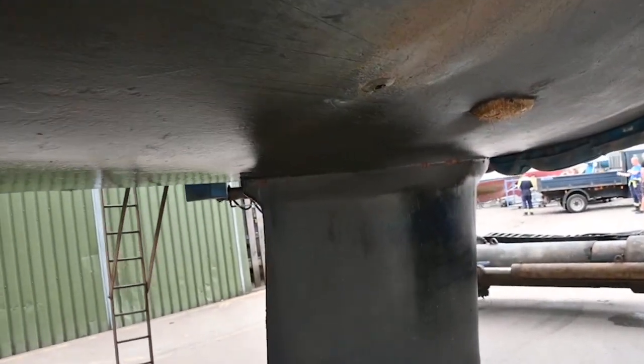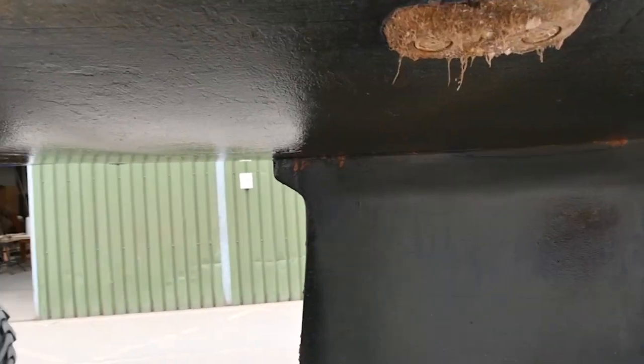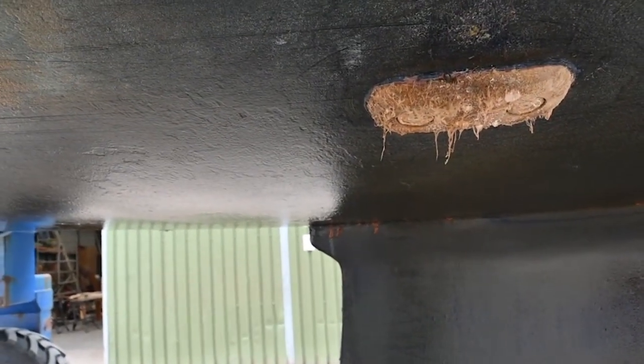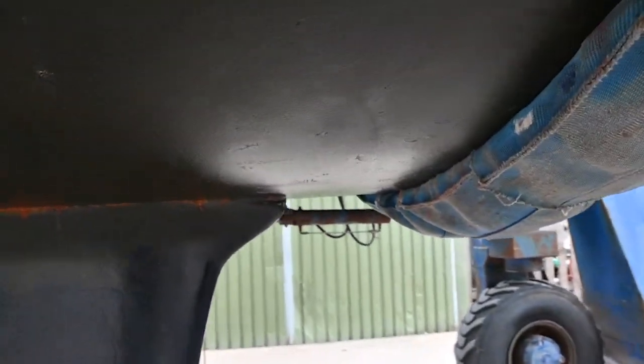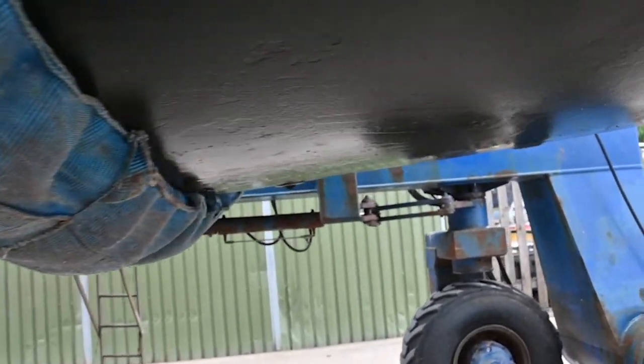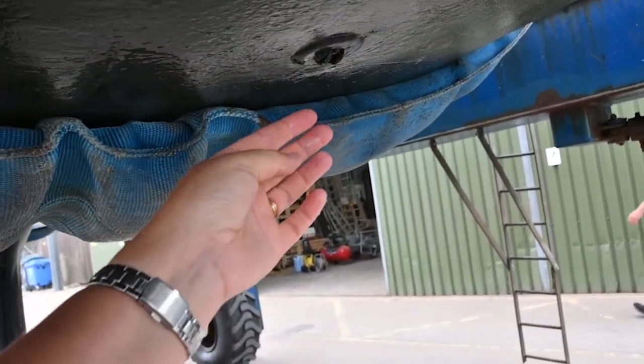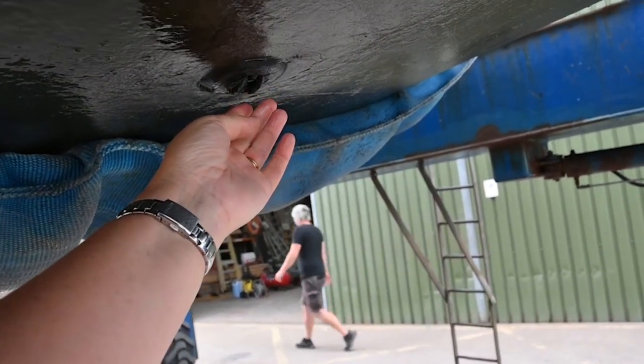The sintered bronze keel cooling plate's got a lot of weed on, so I'm going to clean that as well. And I'll probably have a look at the log. So the log is what registers our speed,